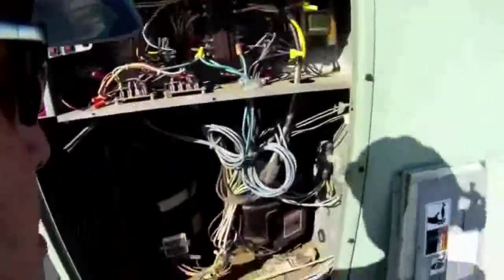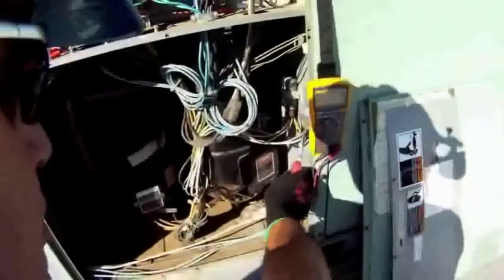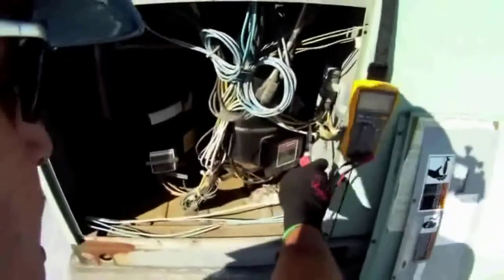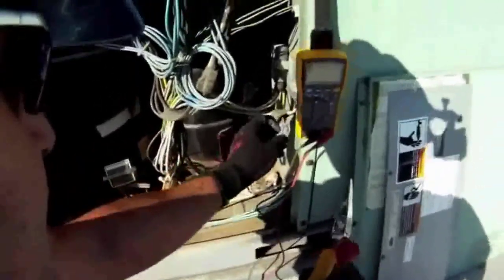This is the capacitor that I'd like to take a look at. I'm going to take my meter — it's got a nice industrial magnet on it, I can set that right there. The first thing I need to do is remove the boot that covers the electrical connections on this capacitor, and then remove the spade connector from one side. Notice I'm using insulated tools. Even though this unit is de-energized, these capacitors are designed to store energy. So the first thing I want to do is dissipate that stored energy. Using my insulated tool, I'm going to short across the terminals, and that just ensures that there's no potential energy there that can affect my readings.